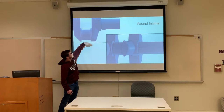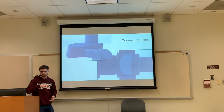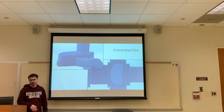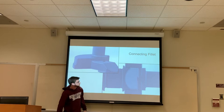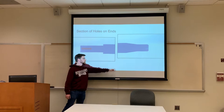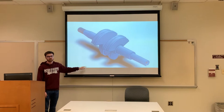After that, the last thing I ran into was this little fillet between this top cylinder and the flat edge here. On the part, it's kind of a teardrop shape that ended in a point with the cylinder. At first I had just a regular cylinder there and I tried to do a bunch of cuts on it, but I couldn't get that to work. So I scrapped that and ended up making a rounded edge matching on the cylinder and then two angles going in from each side meeting here, extruded that triangular shape down and then filleted it a little bit. The ends also had two holes — one was a little bit deeper than the other and it was tricky to measure because the caliper didn't exactly fit in there. This is an overview. After finishing everything, I went through and filleted the whole shape. And then Michael's going to go through the connecting rod.